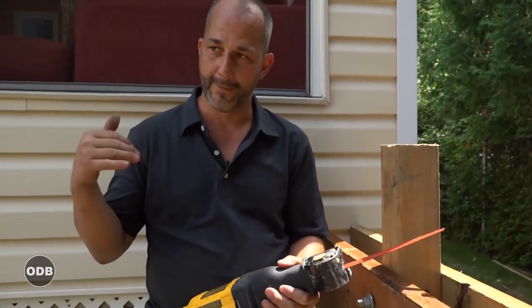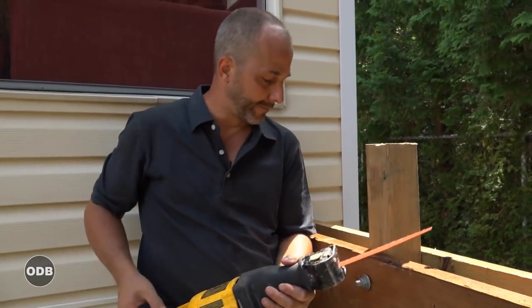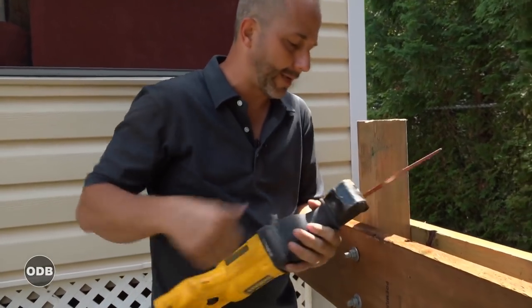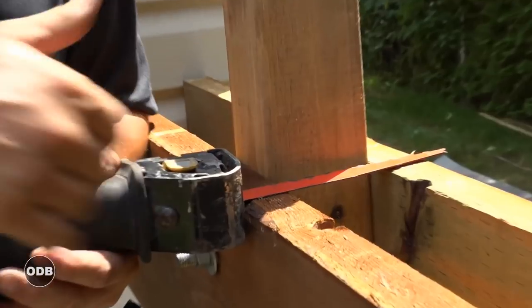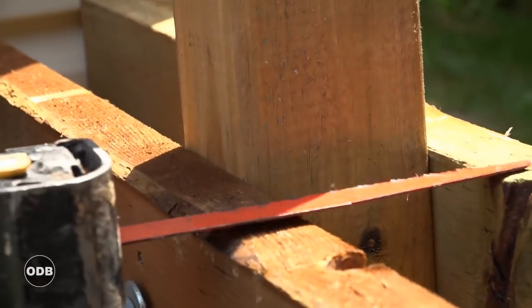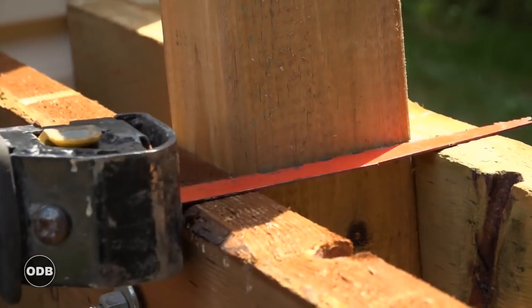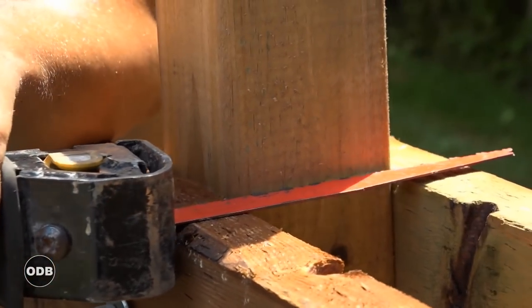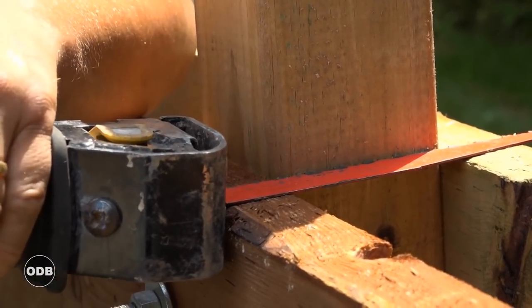The last thing to do to have our box beams all finished off is to lop off the top of the 4x4 post. Once we get our nuts and bolts all attached, the key is you want to have the pedal area pushed against the wood — that reduces the vibration of the tool so I'm not bouncing around. The blade should be longer than what you're actually cutting. You just rest it gently on the two pieces of wood, turn it on, and give it a rocking motion back and forth. I've found that's most effective to keep it cutting in a straight line.